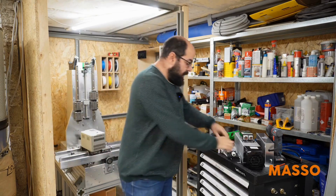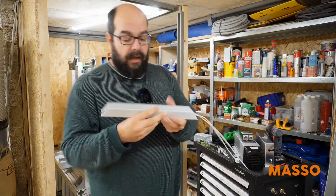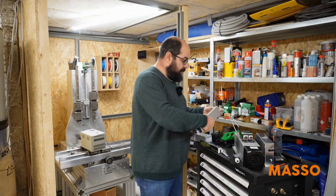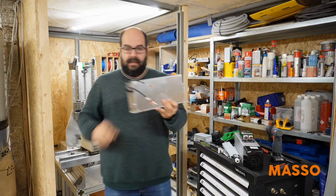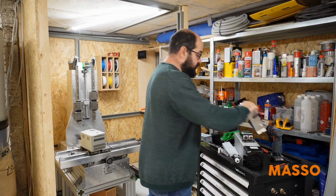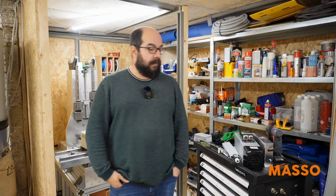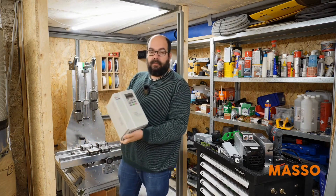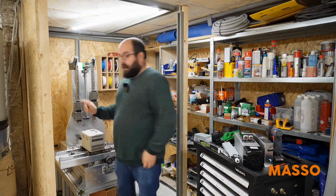Let's take a look — I'm really curious about this. This here is the brake resistor. Those who can compare: brake resistors for a 2.2 kW are not even half as large — so this is already quite something. These are 75 ohms and 780 watts. Also quite funny — that's for this 7.5 kW monster. The network filter is from Schaffner. The price is higher than for a 2.2 kW Chinese spindle. The inverter itself is not exactly cheap — here is the inverter, also a Hoshi.